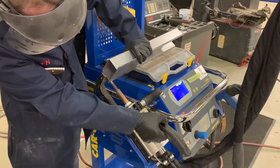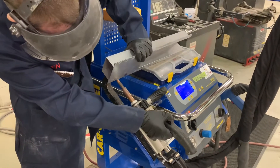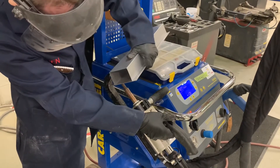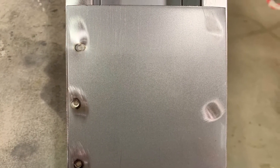Here we're seeing some good welds and some bad welds. One thing to note is that as I'm welding there should be little to no sparks shooting out, because there's no filler material — any sparks or metal being removed from the weld area is a concern. These are generally good welds but there are some differences in the heat affected zone around them.